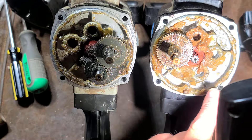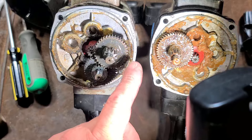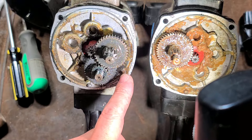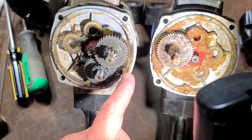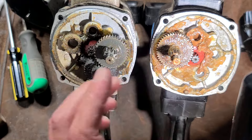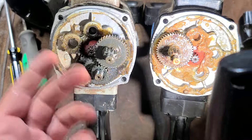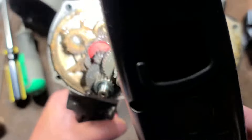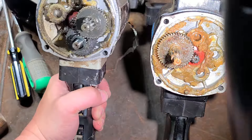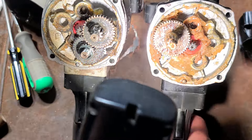You can see there are two idler gears — the higher one connects to the spindle. What they've done is use multiple sets of holes so the same gearbox works for both configurations. For triple reduction they use two holes on the left side, but for single reduction they put the gear on the other side. These gearboxes are absolutely identical — it just depends on where they're placing the bearings. They're all needle bearings, caged, which is just fine.